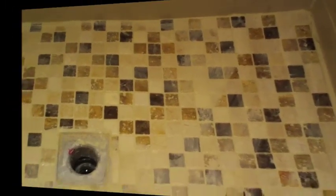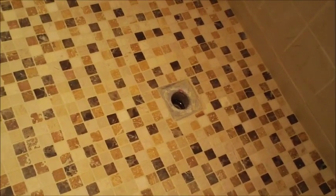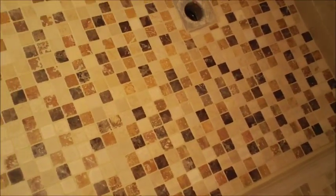If you don't get that haze off, you'll have a heck of a time getting it off when it's dry. So I'm going to keep wringing and wiping — so far so good. We've got the shower stall pretty well knocked out. We'll come back when everything's all grouted with a nice fine rag and wipe everything off so we don't lose any of the color detail. I'm going around being very careful to get that grout spread everywhere and around that drain. The grout is your second line of defense behind the sealer we're going to put on — it's critical for preventing moisture and water intrusion. Properly sealed, it does a good job.